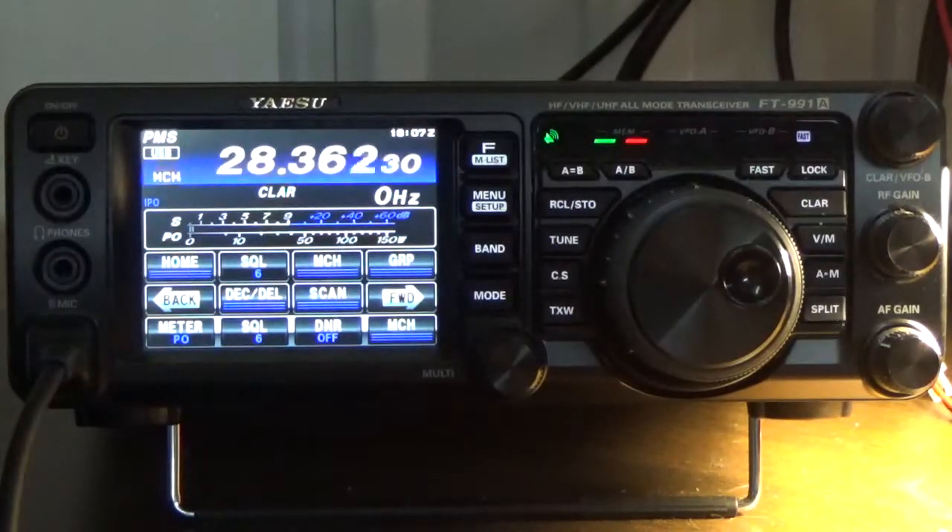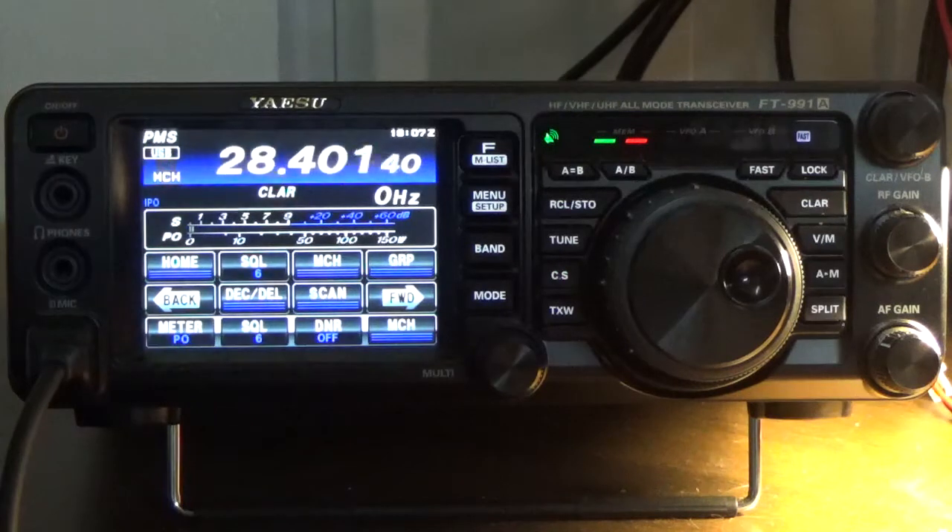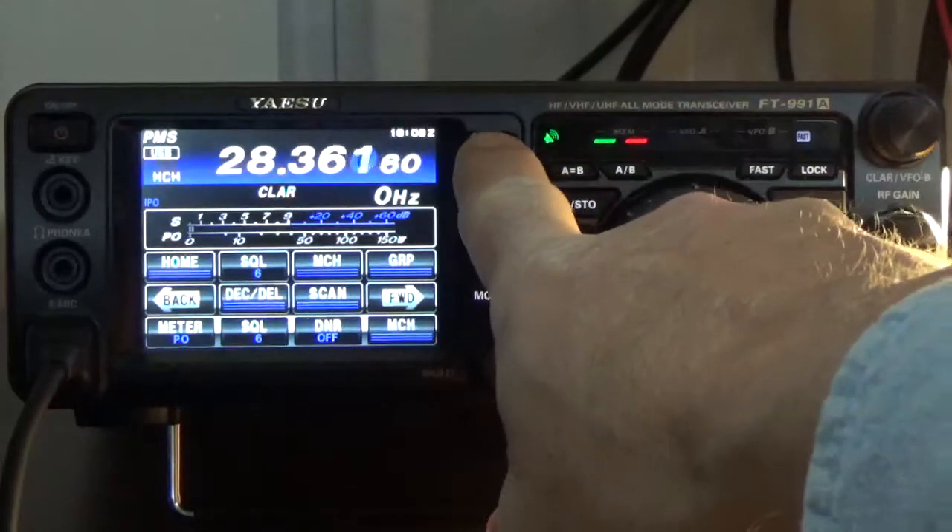You can sit and have your radio scanning while you work, listening to different bands or modes. You could program the radio to go from 28.000 to 29.700, but that may not be efficient — depending on the spectrum area you're in, you might be in FM, AM, CW, or USB mode. My thinking is to segment programmable memory scanning by mode, so your radio is in the proper mode to hear what comes in. To go back to memory mode, press VM once. To listen to the second bank (28.300 to 28.500), select it, turn the VFO slightly right to go to PMS mode, then Function > Scan.